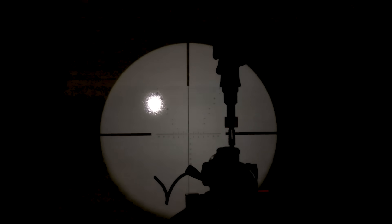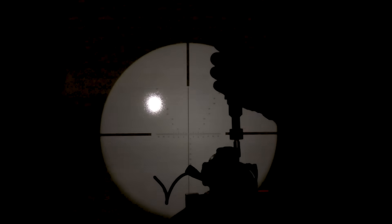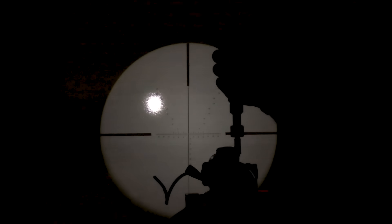Just a single light touch of tension to start — no full torque yet. One nice thing is you can watch through this process to see if you've induced a little weeble in the wobble. I've brought these down and I'm going to start going through them, applying torque incrementally, moving between different banks of the ring screws.